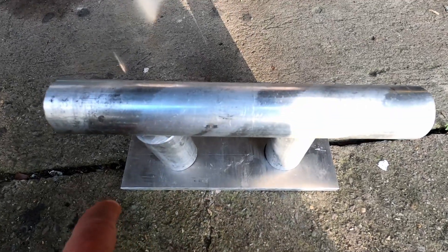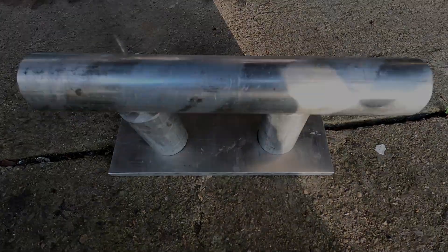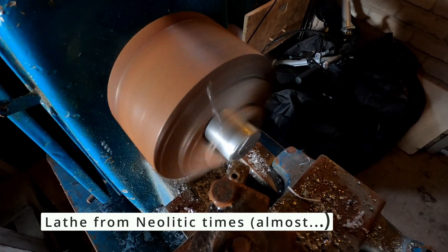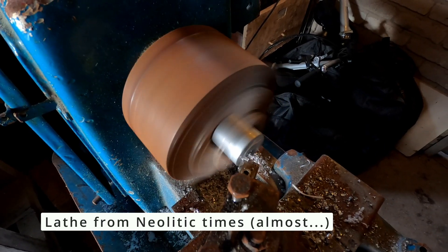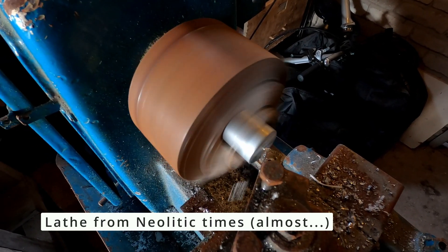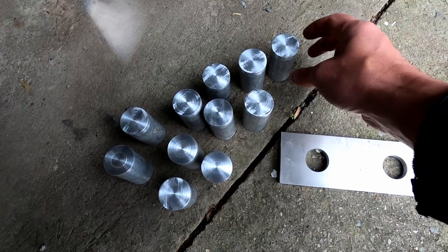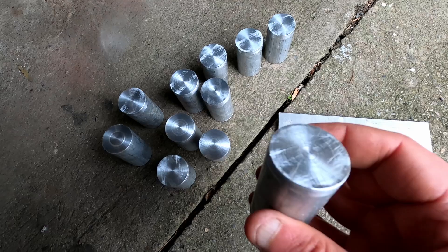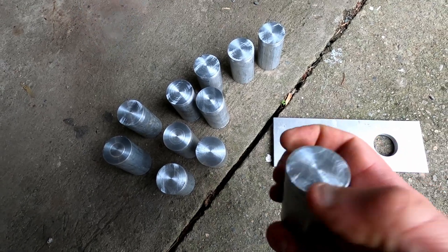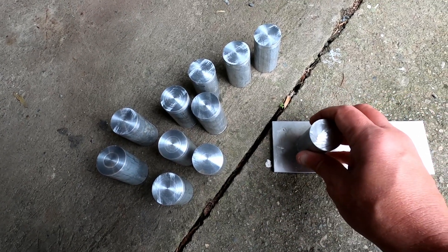It should definitely be strong. This part here can be welded to the deck once I have a deck. I need six of these. I'll start by making sure one of the sides is flat. I now have 12 of these with a flat surface. All I need to do is go in 5mm and also 1.5mm because this is 35mm — and it is 32mm on the other, and this is 35mm — so I want to go in halfway to slot into this hole.